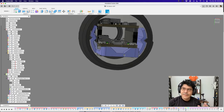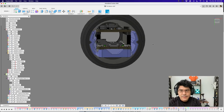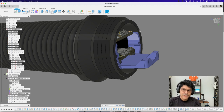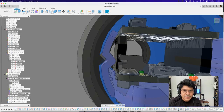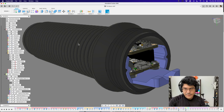I think these are the golden standard dimensions for props going forward — the internal geometry diameters I'm going to use consistently because they work out really well for this setup and should work across many different props. The pull tab is also important: once the holder is fitted inside the handle, you can't dig your fingers in to pull it out, so the tab lets you reach in and pull it. With 0.5mm clearance it slides out without being stuck.